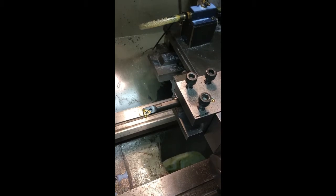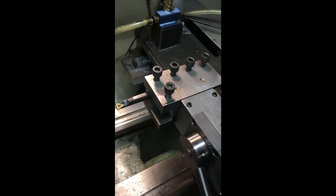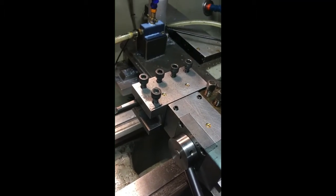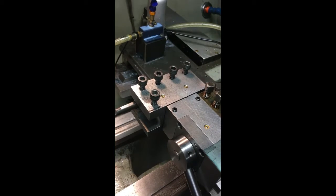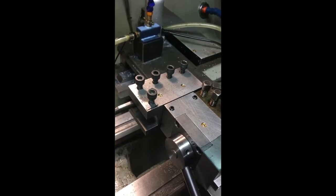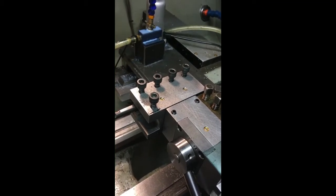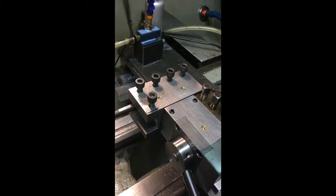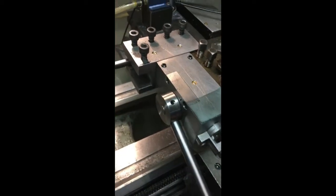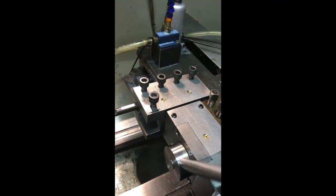I can use tip tools in it as well as ordinary high-speed steel or tungsten carbide ground tools. It's based on the G.H. Thomas retractable tool, but his was only designed for external threads. I think it's more beneficial for internal threads than external threads, so this is what I've come up with. The cam movement drives it forward and out.